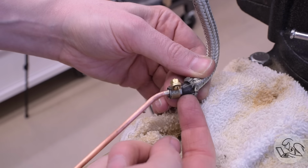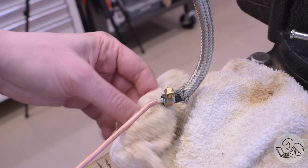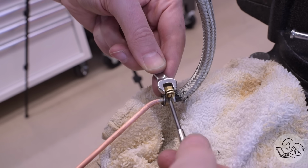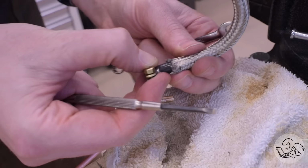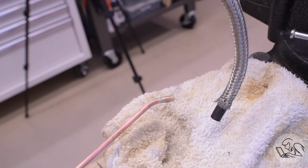Whoa, it's a balloon. Crazy, crazy. Then I thought, you know, I don't think I actually checked what the pressure capacity of this hose is. Maybe we should go look that up. I chose it on McMaster because it was the right dimensions inside and out, and it was a nice soft rubber, so it was nice and flexible, and it was also silicone, so it won't mind the heat of a steam engine. I thought, yeah, this is, I'm sure, a good choice.